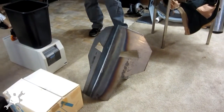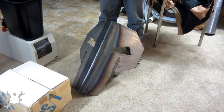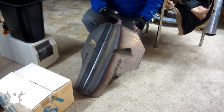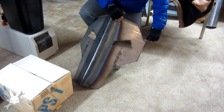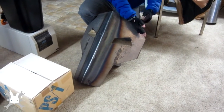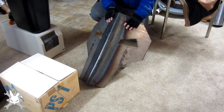You want to explain how the plasma cutter thing worked? Because it's not CAD — it's magic. Does the metal you put as guides have to be a certain thickness? No. I just used some angle iron, like an L shape. I measured off how far the plasma cutter head was from the flame. Then I put those dots there, put an L-shaped piece of metal down, and I could just go straight all the way down and make a straight cut. How fast does it cut? It just cuts like butter — right through it.